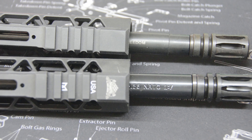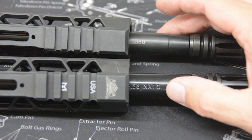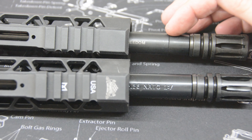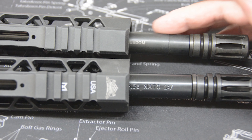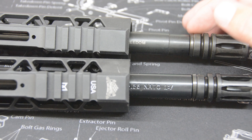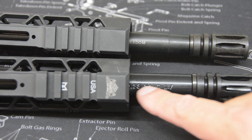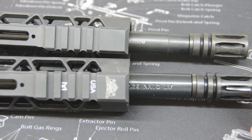I'm not sure these are from the same manufacturer — I kind of wonder if PSA was buying different barrels at the time. The blemished one has laser-etched text and an additional step down in barrel diameter near the muzzle. We can measure those later when we do the final tear-down. The standard upper's barrel has CNC-engraved text — '556 NATO' and '1-in-7 twist' — machined directly in. The finish on the standard is much nicer, shinier, very uniform. There is definitely a difference in the barrels.